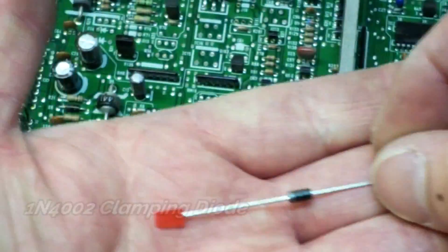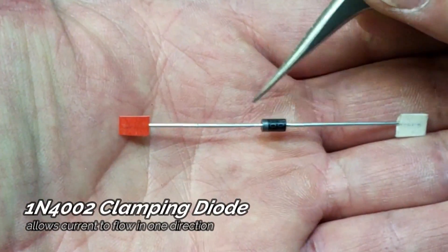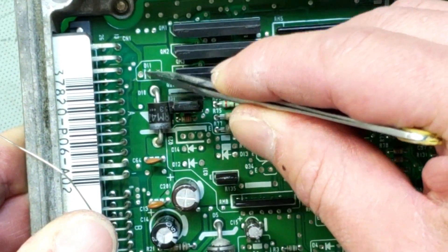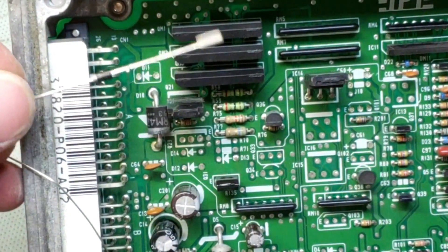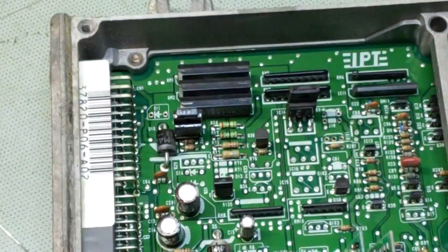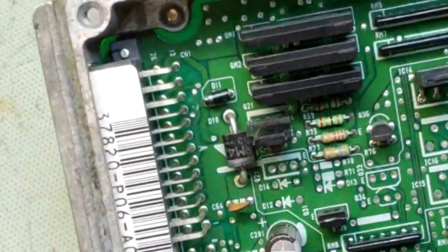You can see how it's nicely flowed to the other side. Next we have a diode which has polarity — see that gray line right there. On the board it points to that line right there, so you have to put it that way. It'll go down in that direction, and it'll look something like this once it's in and soldered.